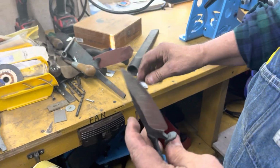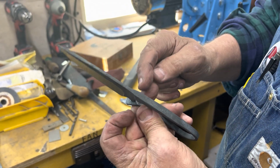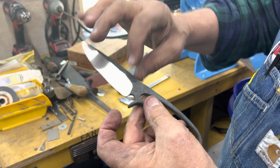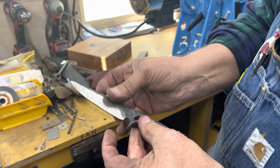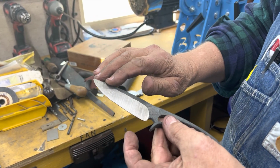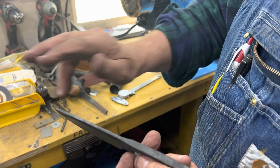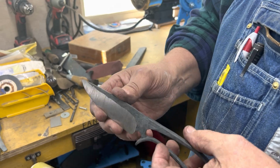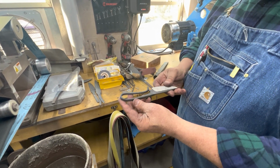So whenever you forge this step and this step with the vice jaws, that pulls everything back, and then this back bevel makes this grind work. If you just bring it off any old way, the grind's not going to look right. It just surely won't. So you have to think about all that stuff.